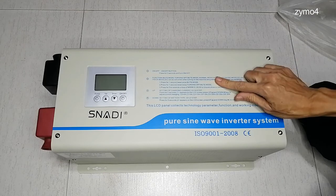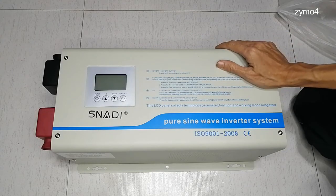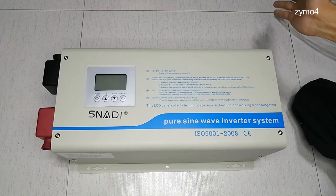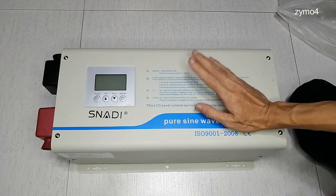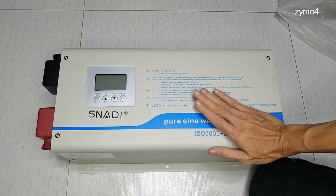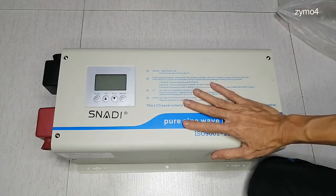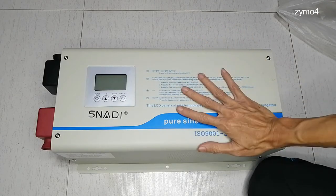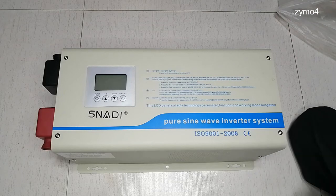There are simple instructions here. It's a pure sine wave inverter. It has bypass mode and UPS mode — I think it only has two functions: bypass and powering the load using your battery. This is an entirely pure off-grid inverter with AC charger. It can charge your battery if you don't have a solar panel yet, so it will act as a UPS. Majority of off-grid inverters are essentially large UPS systems in that sense.